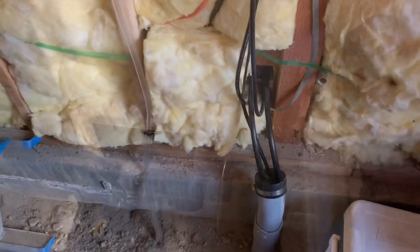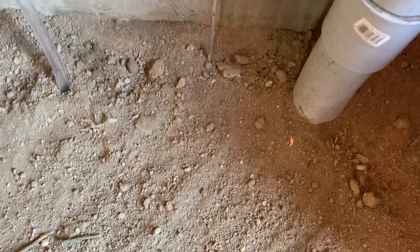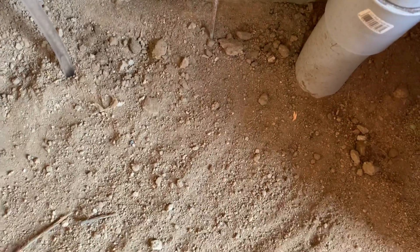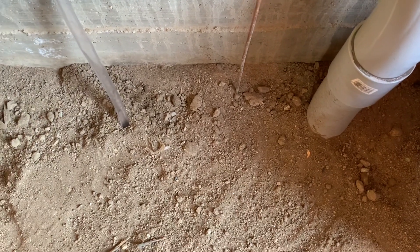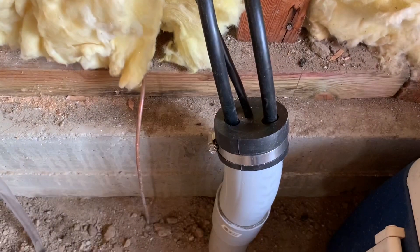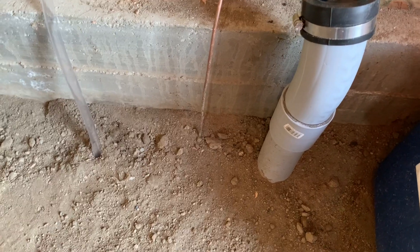On the other side of the plate is my cellar — we're going to go in there. Here's the other side of that plate with all the feed lines tying to it. The number 4 solid on this side then goes down. There's another 8-foot 5/8 ground rod buried under the ground here, and the copper number 4 solid copper — all my rods and connections that are buried have exothermic bonds, so they're all one piece. I feed some LMR 600 feed line into a conduit which I then run across the cellar underground.